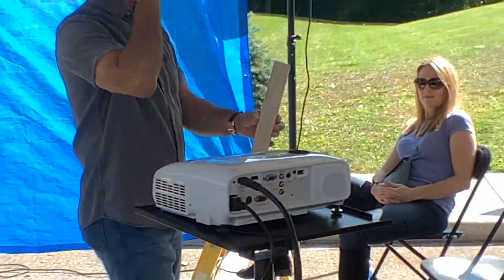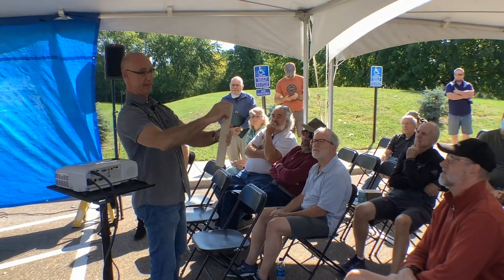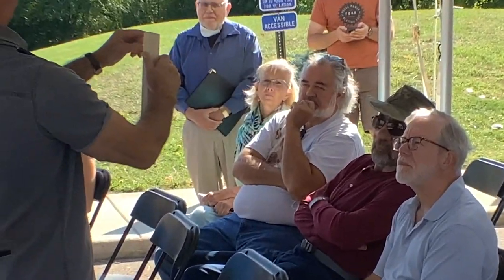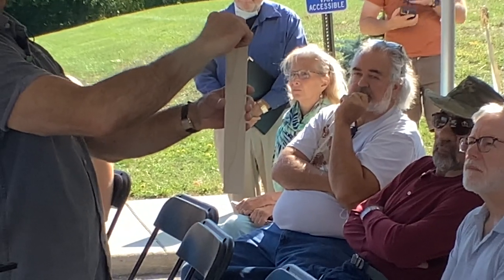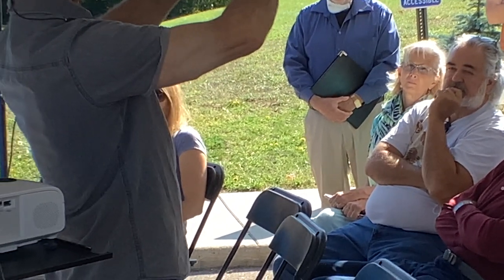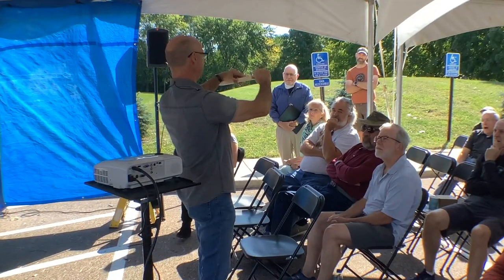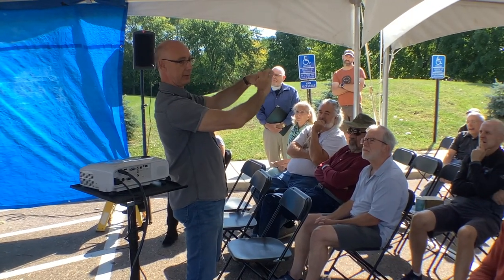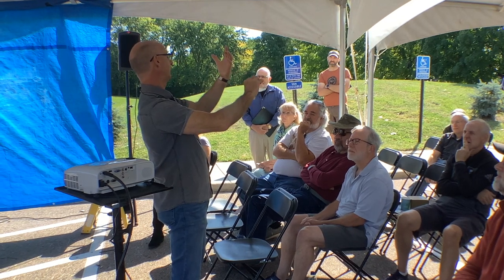This is way better. Here's what I'm looking for. We have this lip on the front and this shoulder on the back. I want this lip to be about half as big as the shoulder here. Generally, it works out to about 3/32 on a 3/16 step in 3/4 inch material.